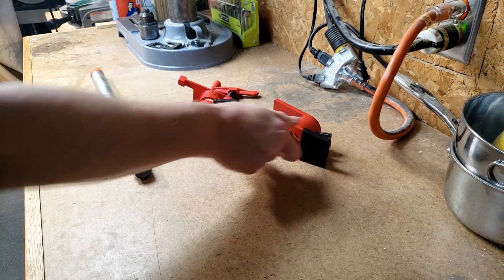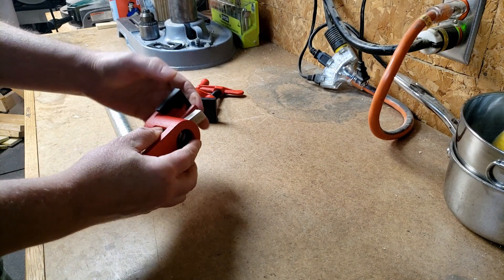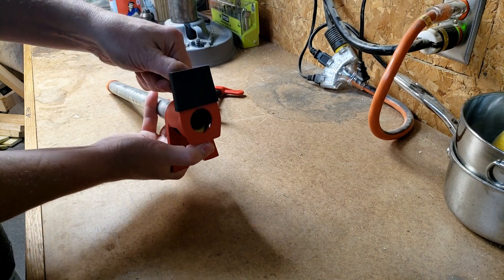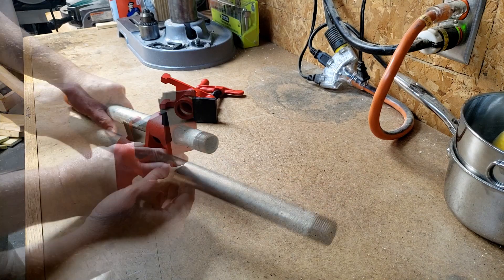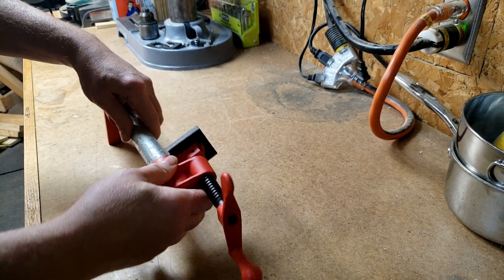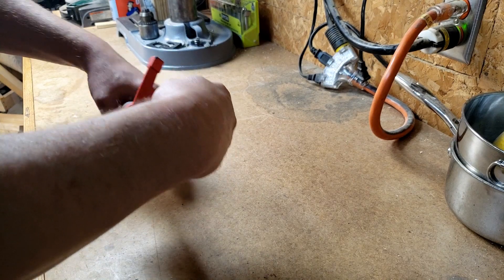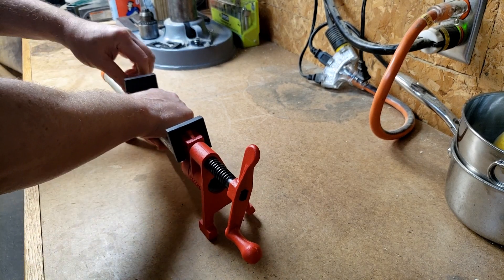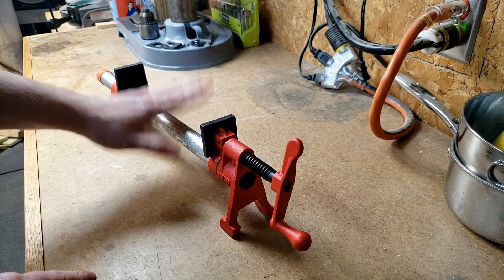Here I am assembling a small 18-inch long, ¾-inch galvanized pipe clamp. First, I install the sliding part, which has the clutches that will grab hold of the pipe. To move the sliding part, you squeeze the clutch pack against the body of the clamp and it releases the clutches. Second, I install the threaded clamping part, which has threads already cut into the clamp that screw into the pre-threaded pipe. One often overlooked benefit of pipe clamps is the feet on the clamp — this raises the work slightly and means the clamp sits in the correct orientation for placing the work without holding the clamp upright.